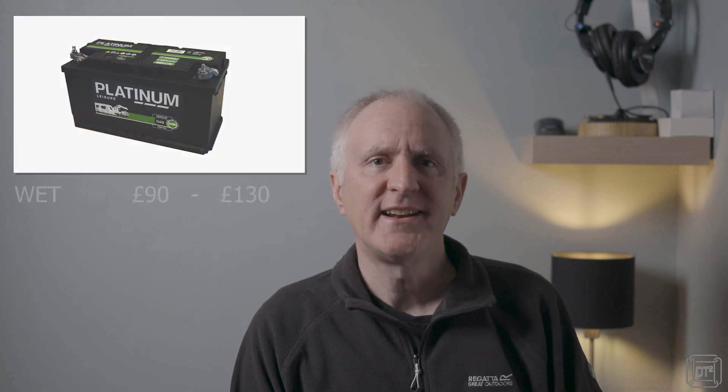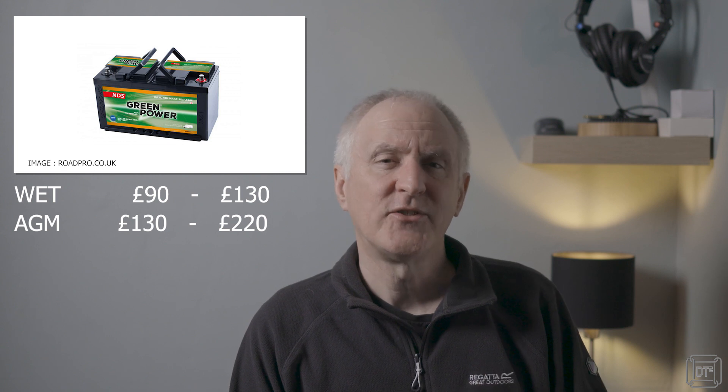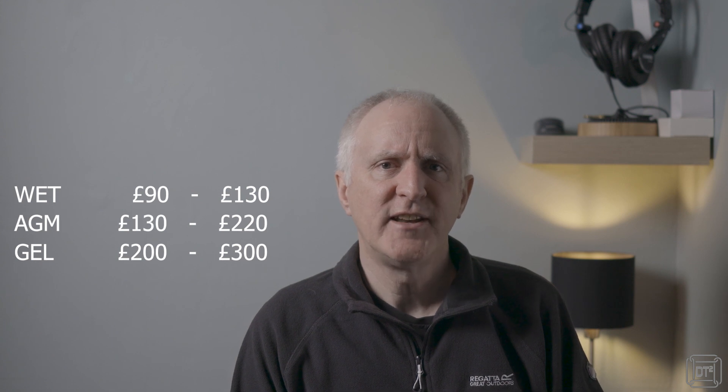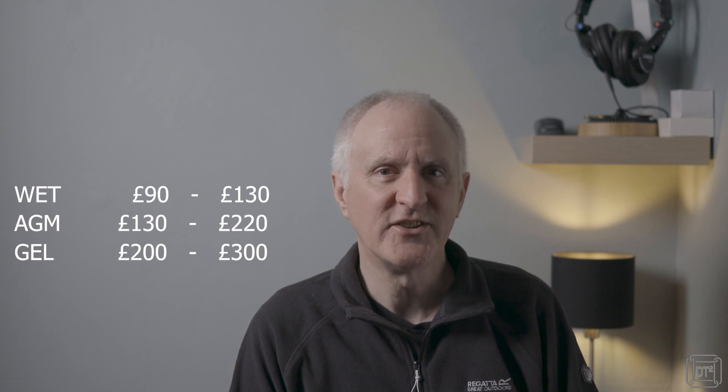When it comes to cost, standard wet lead acid batteries are the lowest priced, with a typical 110 amp hour battery ranging from about £90 to £130. AGM batteries range from the upper end of standard wet batteries rising to about double the price. Anecdotally, AGM batteries can provide a longer service life than wets, broadly in line or better than their cost ratio. The additional cost of AGM is probably worthwhile mainly for the safety, low maintenance, and ability to deliver somewhat higher currents. Gel batteries offer similar benefits to AGM with a higher stated number of cycles, but they are harder to source and significantly more expensive, and several suppliers indicated the cost-to-benefit ratio of gel versus AGM does not typically justify the additional expense.